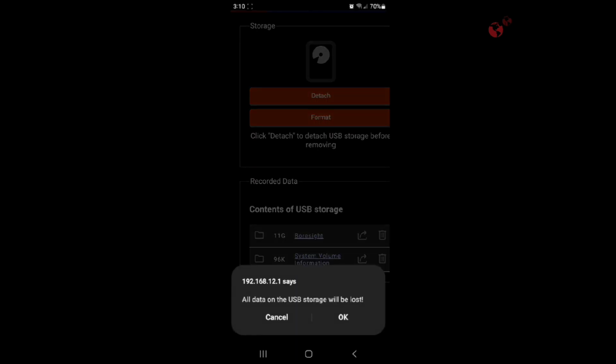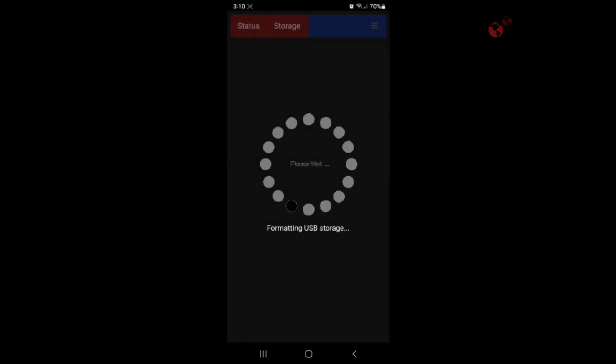If you have any projects you've done previously, make sure they are backed up on another drive or your PC before you do. While formatting this USB stick, make sure you realize you cannot format it on any PC or desktop in a quick format setting. It has to be formatted on the LiDAR unit, on the XT32 unit itself. It uses a special XT32 format. If you do make a mistake and format it, call Atlantic Laser.